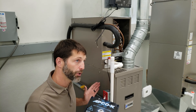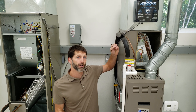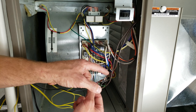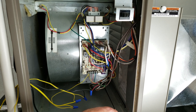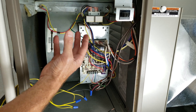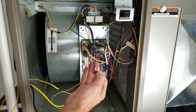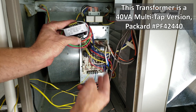You'll need to look at the local electrical codes and refer to your electrician. For the 24 volt wire, we're going to take our power from the lower portion of our gas furnace — in the lower gas furnace electrical compartment. We have our two wires; we want to attach those to R and C in order to get our 24 volt power. You really want to take into consideration your existing transformer. If it's a 25 VA or 30 VA — or if it's a 40 VA — that's going to be able to handle more current. We also have a 3 amp fuse. You just don't want to overload the transformer. In the case where you have multiple accessories or two UV lamps, you're going to want to install an additional transformer to supply the 24 volts.